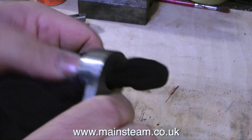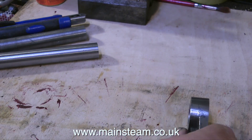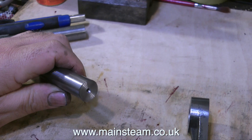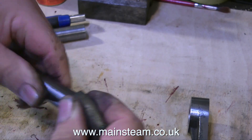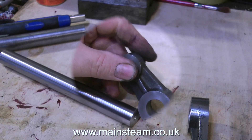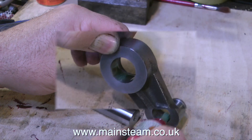The first thing to do is clean out the crank web. I'm using cellulose thinners — or lacquer thinners as you call it in the USA — giving it a thorough clean. Then I'm going to use Loctite 603 to bond the shaft into the hole in the crank web. Before applying the Loctite, I'm roughening up the end of the crankshaft with a piece of fine emery cloth; this acts as a key for the Loctite and makes a very firm joint.